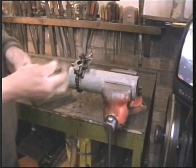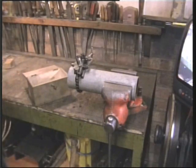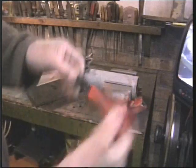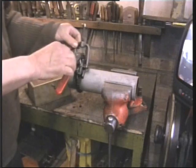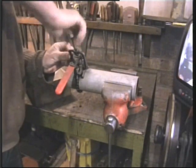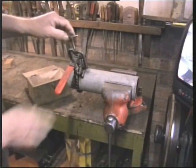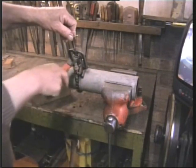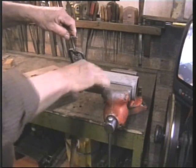And so the drill and tap is fed in the top. A ratchet goes on top of the square. Then this is swung over and the T-piece tightened down. I won't actually drill through this piece of pipe because I want this piece of pipe, but you can see the action. We just carry on, we drill through, and when we get through the actual pipe we keep going and we put the thread in.